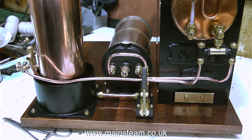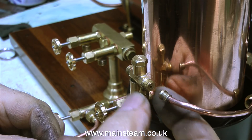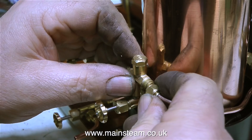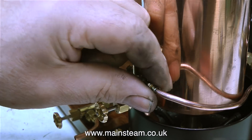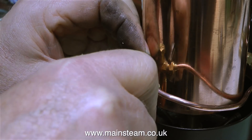When I picked the tank up off the bench I noticed there was some water in the tank. As it was a very small amount I tipped it out onto the workshop floor, which was lucky - because normally I tip water out in the garden on a gravel path. All I had to do was follow the water trail and there was the cone on the floor. So now before I lose it again, I'm tightening the union nut which is now holding the pipe onto the cone, so that's one side of the injector done.